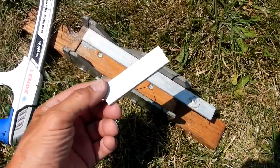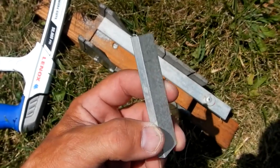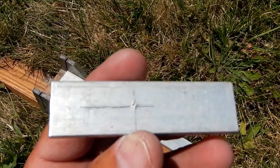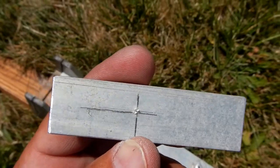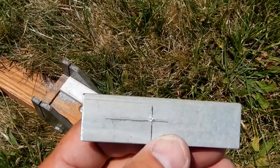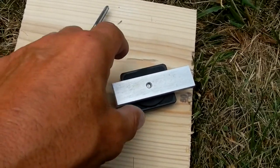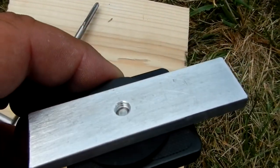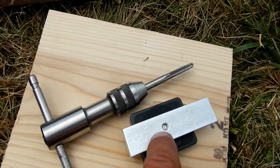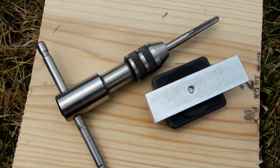For my particular purpose, I cut this piece of aluminum three and a quarter inches long. Now I'm going to deburr it and locate a quarter-20 tapped hole for the new tripod socket. From the left side, I wanted to come in one and three-eighths of an inch and center it on the stock. This stock is quarter-inch thick by seven-eighths of an inch wide, so seven-sixteenths would be the center. The proper drill size is a number seven, but most people may not have number drills, so you can get by with a 13/64ths and you'll be perfectly fine.